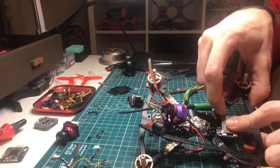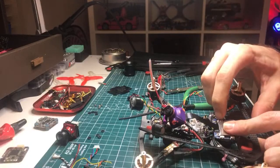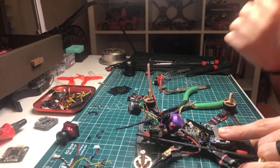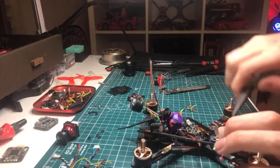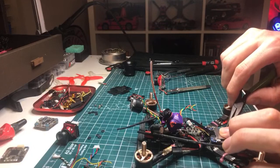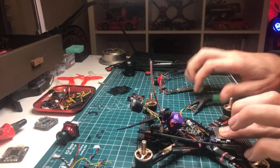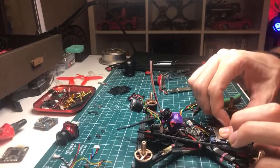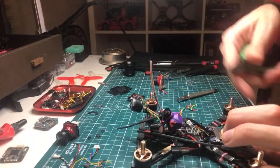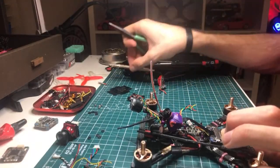So here's what's going on here. Runcam made the corners of this thing recessed down, and it's really making getting these nuts on a pain in the ass. So here is my solution to this. Flip the screws and nuts upside down. Run the screw down from the top, and then put the nut on the bottom with some Loctite to make sure it doesn't fall off.